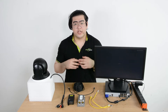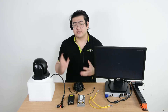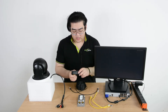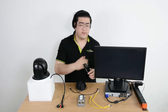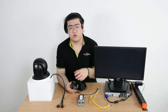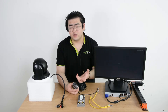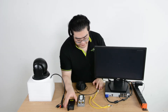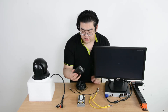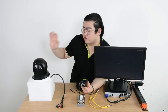So what do we do? We can connect some small devices like a router access point to it. If we need something to provide a high amount of power, we can use a PoE injector. This PoE injector will connect between the IP camera and the PoE-NVR. When the PoE signal travels to the injector, it will only pick up the data and then use its own power source to combine with the data and transmit a new PoE signal to the IP camera. Basically, the PoE injector takes the data, combines it with its own power, and sends a strong PoE signal to our IP devices.